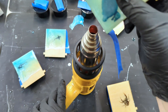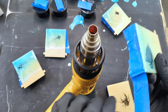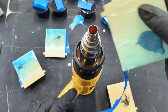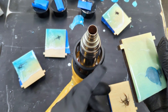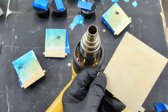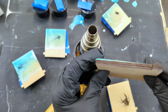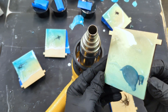It's a good idea to wear gloves — preferably work gloves for protection. Now just peel the tape; do this for each side. Do not let the tape touch the nozzle. This angle is deceptive, but the tape is not actually close here. Only a few seconds is needed to heat the resin enough to pull the tape off, revealing perfect edges. If you did get some leakage, you might have to do some light sanding so the lid will fit properly.